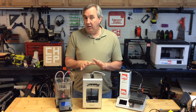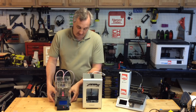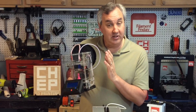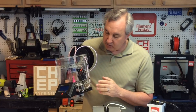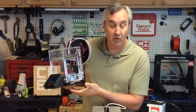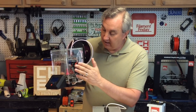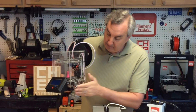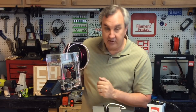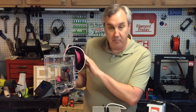That's the way the original Fabricator Mini was — this is my original Fabricator Mini 1.0. It was designed to connect to a computer and control it from the computer. I got tired of that after a while, so I reflashed the board. This was open source so I could get to the Marlin firmware. I reflashed it, added a full graphics LCD with full-size SD card, a base so it could get air underneath to cool the stepper motors — which was a problem, as the small stepper motors would overheat — and a spool holder.